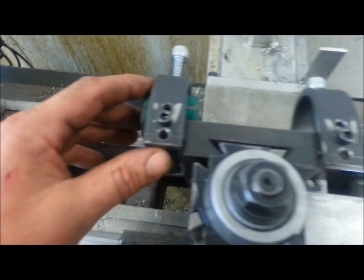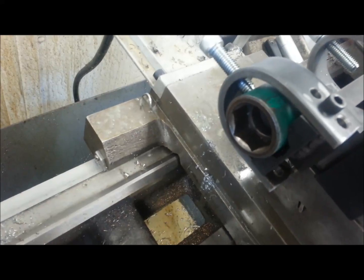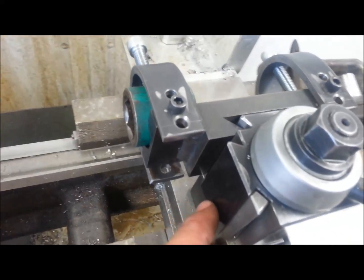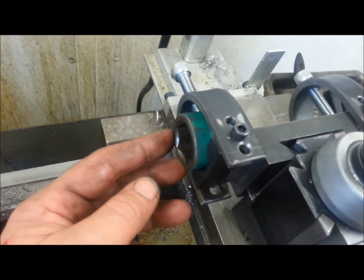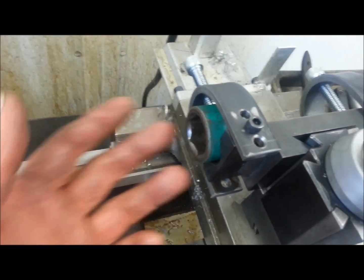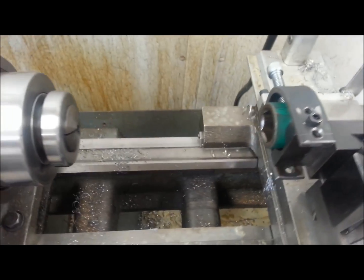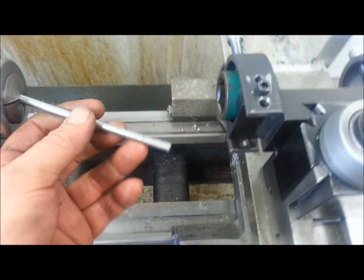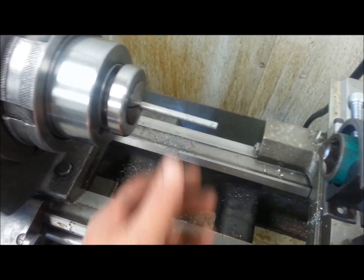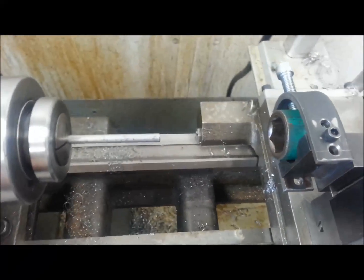Here's the next little segment with our yoke tool holder. I'm only using one of the yokes, and that's an impact socket in there — we're down on center. It can't help but be on center; that's the way the tool is designed, so the center of that impact socket is the center of the spindle. We're going to take a cad-plated rod and lock it down.